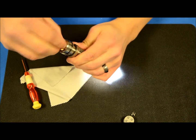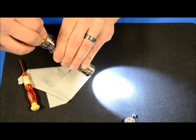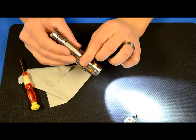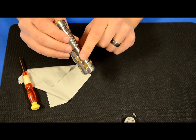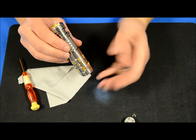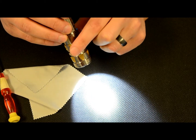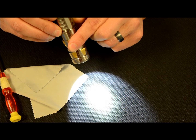Let's test our switch operation. Switch feels good — we don't get any flickering. All the way counter-clockwise turns the switch on, clockwise turns it off. From the selector ring, we've got it on standby. Turn it on and we're at the lowest mode, then rotate right all the way up to high. When you are at high, you'll feel a little indentation and the ring will stop. Rotating back off, there's a little bit of flicker as it comes off turbo high mode and goes back into variable adjustment mode.